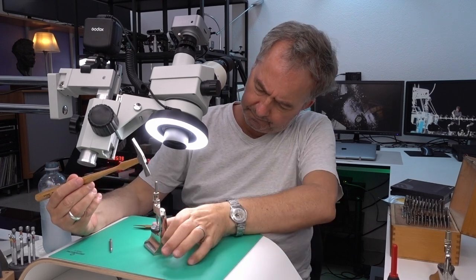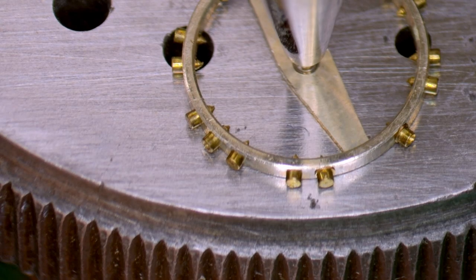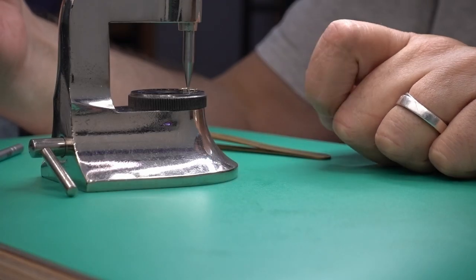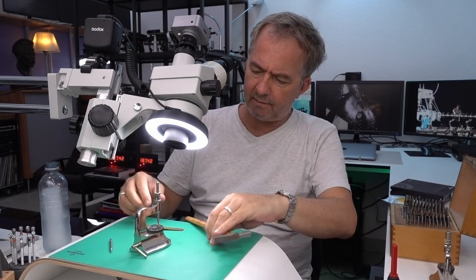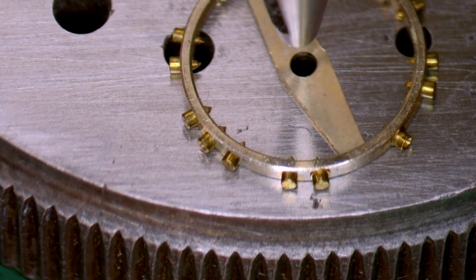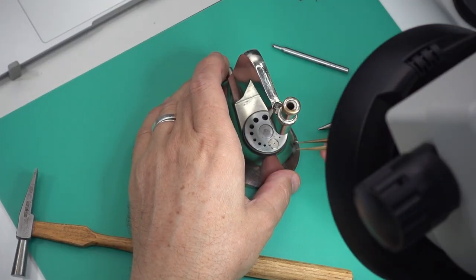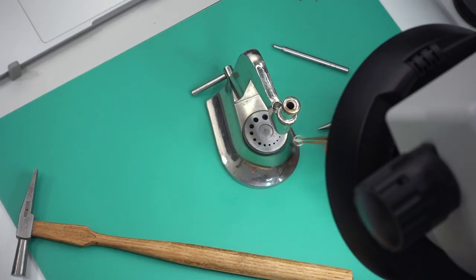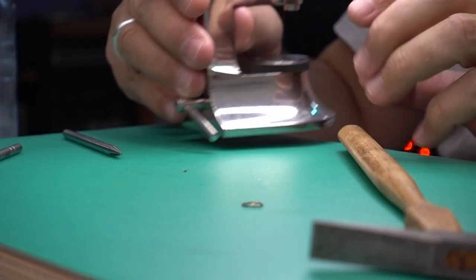The staking tool has a hole in the bottom of it, so that the balance staff will slip out and land on the table. I felt something go there, so let's see what happened. Yeah. So that's gone. And then what was critical here is that this flat side was down, so I didn't bend the balance wheel. If I lift this, I find my...